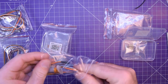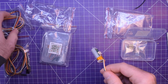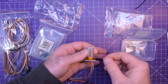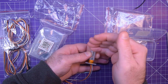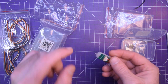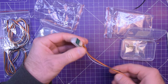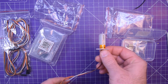They do the same thing as the BL Touch. You've got these wires coming back towards the main board, and it actually comes with extensions as well. This thing rides on your carriage and it has a solenoid in here which will activate — it'll come down, the Z axis will come down to touch, and I think the movement of it captured in the coils will detect the Z axis. I did see on the listing that you're not supposed to pull on the plunger while it is unplugged — you're only supposed to actuate that with the main board itself. These were kind of expensive — it came up to about $26 for two of them.